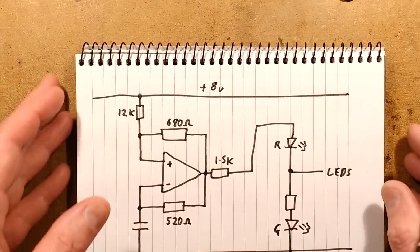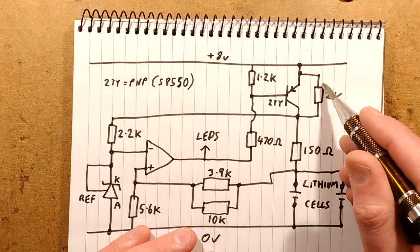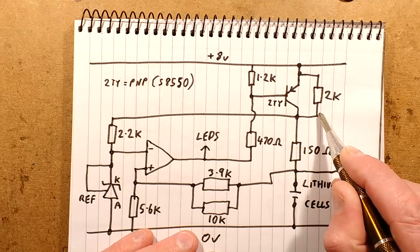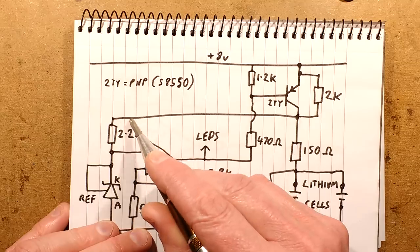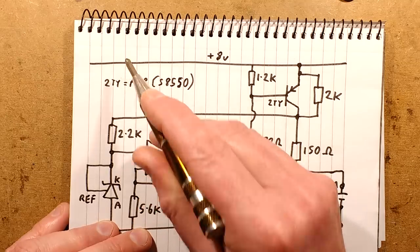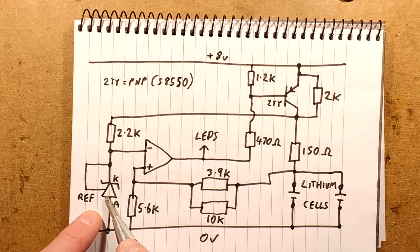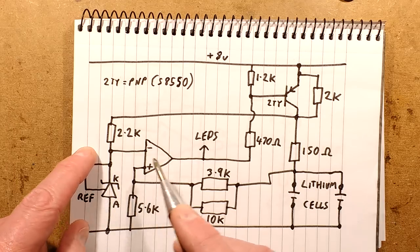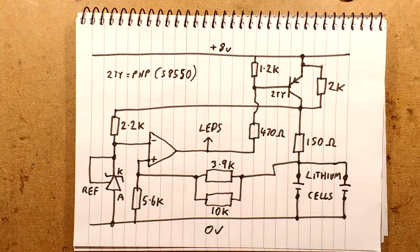Now I'm very intrigued — I want to make a modification to fix the leakage. I'm going to remove the 2k resistor completely and take the connection directly up to the positive rail. That means the 431 will get its current for its 2.5V reference with no current leaking through. I'm not sure why they didn't do that in the first place. On goes the soldering iron.